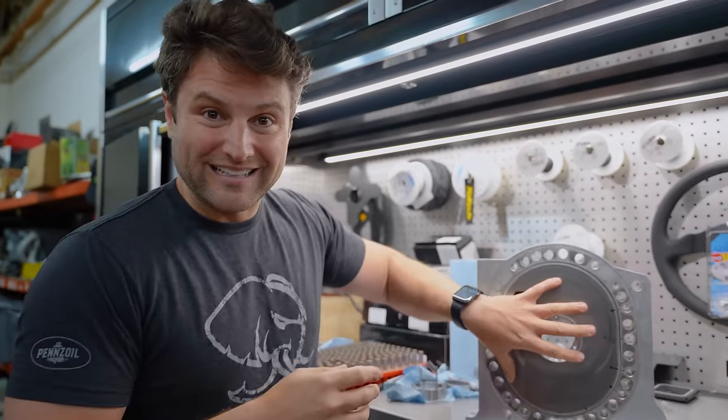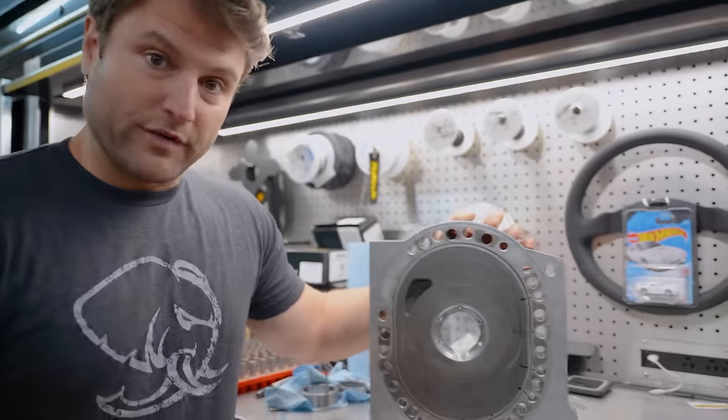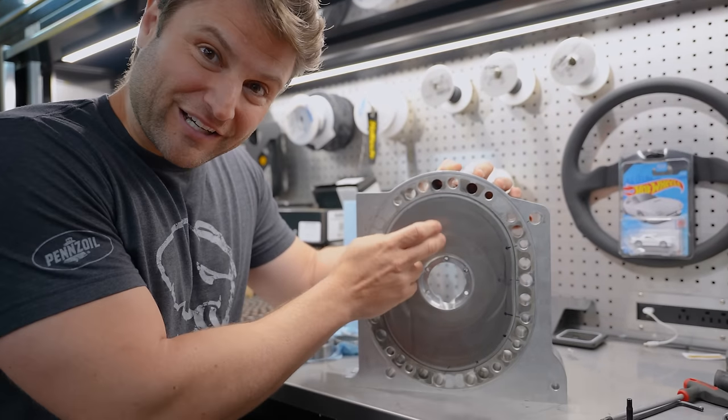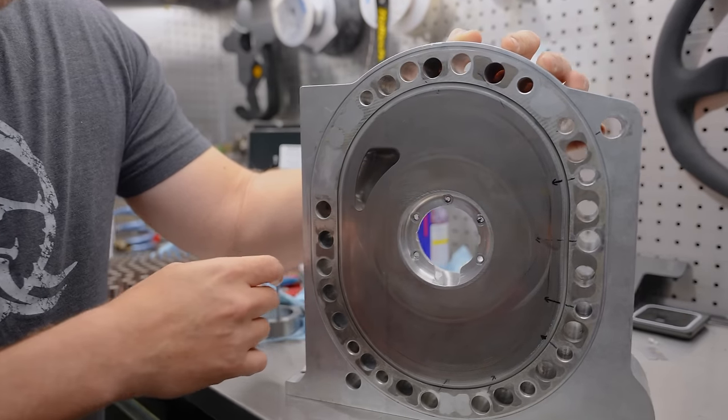At those temperatures, the aluminum expands at about 2 to 3 times faster than tungsten. Say aluminum expands 3 inches, steel will expand about 1.5 inches, tungsten will expand about 1 inch. You have a problem where if you get this thing too hot, the two are growing at different rates and you will cause the two to separate. We will try to avoid that by cooling it better. And thankfully, tungsten chromium carbide is actually a decent conductor of heat.